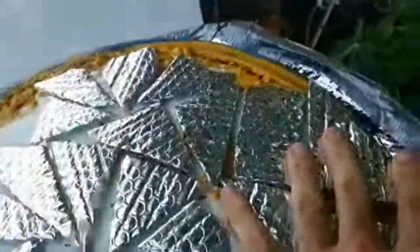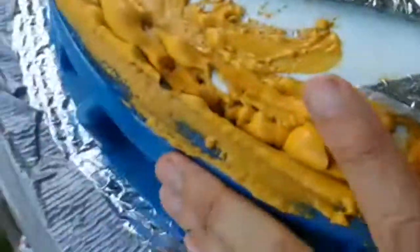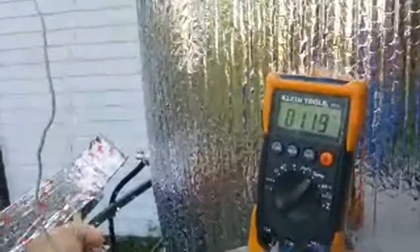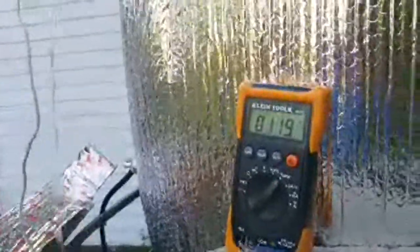I guess for now I should let air in while this is draining out. I wonder what would happen if I seal it. There's no vacuum here. So let me climb down here very gingerly. Now it's at 120 again. And the reason it goes up is because, as I keep saying, the hottest water is always at the top. It's like a layer cake. So yeah, it's really good for washing those baby diapers.